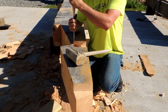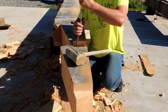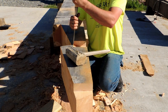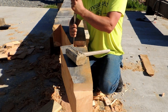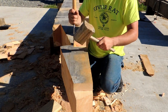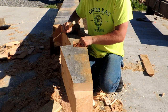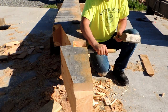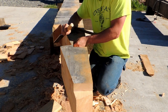This last part is where it's real easy to get off — you have a tendency to want to dive back into the bottom of your joint. This is the part of the joint I'm really concerned with. I want it good and square, because this is going to be all your bearing surface. If you get it out of square one way or the other, you're going to be crushing down because you're not evenly loaded on the joint. Your joists are going to sink in a little bit — could only be a quarter inch or an eighth — but it's enough to be a pain.